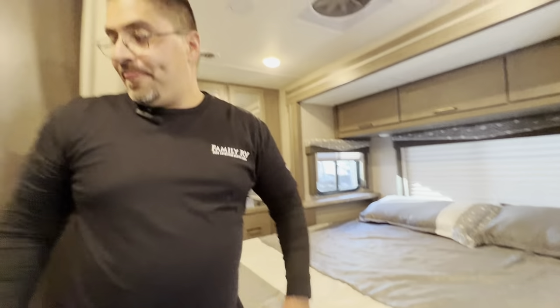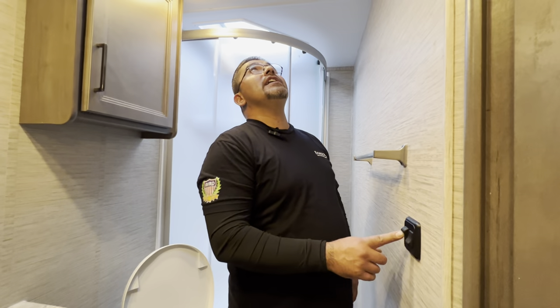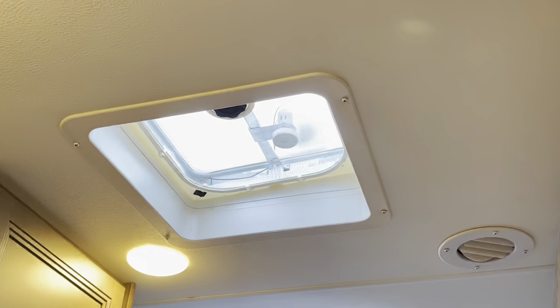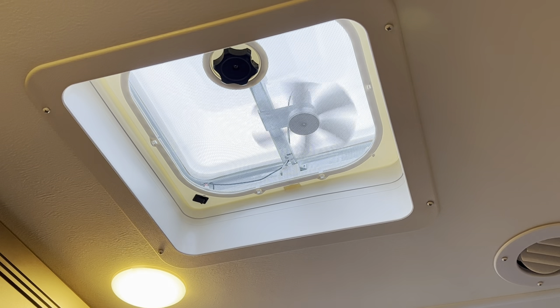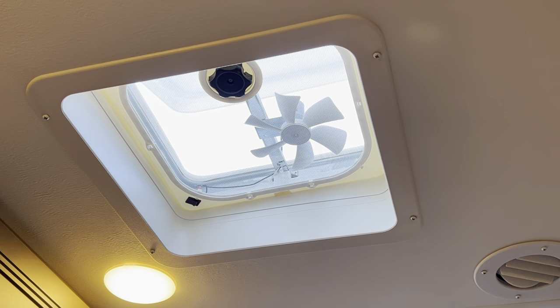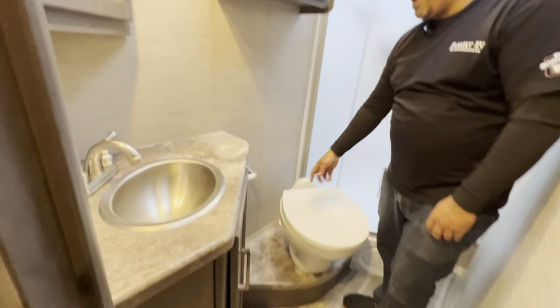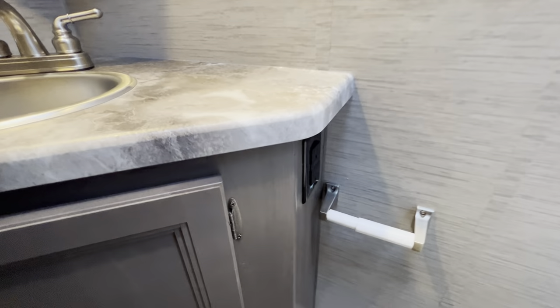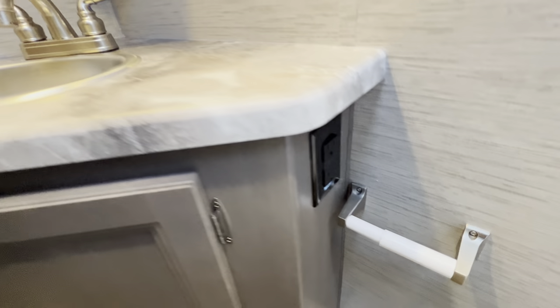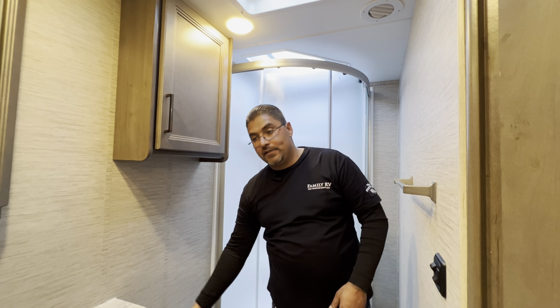Let's go to the bathroom. There are two wall switches: one for the light and one for the fan. The vent fan also has two switches — leave one on and control it from the wall switch; just twist it open to use the fan. Also in the bathroom, there is an outlet that is GFI protected. Many outlets are controlled by the GFI — too much power from a curling iron or blow dryer can trip it. Simply push the reset button in the middle to reset it.